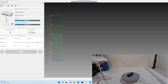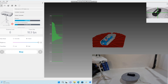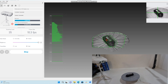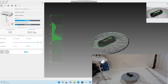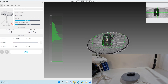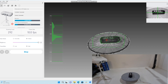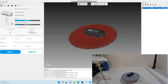We can stop the preview and click Initial — this is the second step. In Initial, everything that is red it's going to disregard, and everything that is blue is what it's successfully capturing. Going to Scan, you can see it starts and now all these green dots are certain points building up to create our image. The brightness is on max right now — brightness is very important and will be a different setting for each item. It's building the bed and building the item, even grabbing the buttons as it does this.